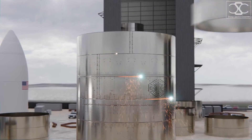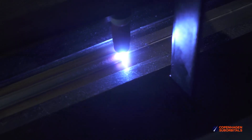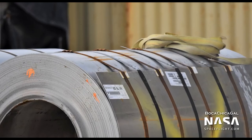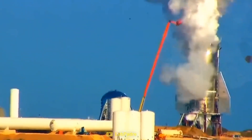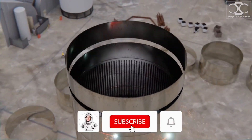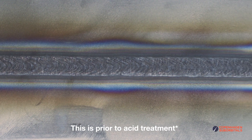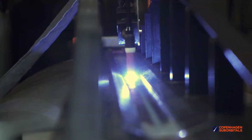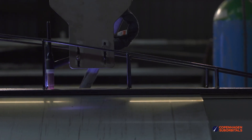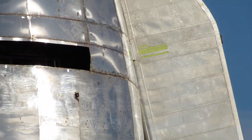Let's discuss the superior welding techniques used in making Starship and what role they played in its design and function. Welding was one of the most difficult aspects of the first Starship prototypes. Each ring was originally constructed from numerous sheets of 301 stainless steel roughly 4.5 millimeters thick, and welding these layers into one body was very difficult. The early prototypes used a flux core welding process, which involves passing a voltage through a metallic wire, creating an arc that melts the metal. The wire tip falls into the molten steel, filling gaps, while a surrounding substance burns to release a protective gas shielding the weld from atmospheric oxygen and corrosion.